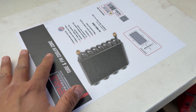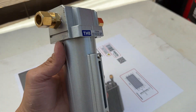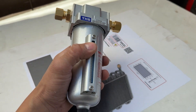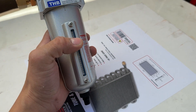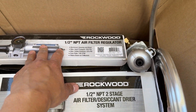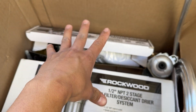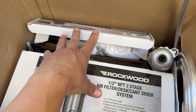This is the main piece — an after-cooler I got on Amazon. I also have this automatic water collector; since it's going to be behind the compressor and not easily accessible, it'll automatically drain any water that fills up. This is the complete filtration system — a filter with a regulator — and these two together may be overkill, but they go after the copper cooler.